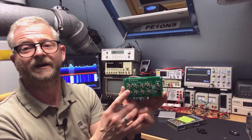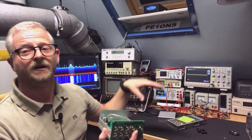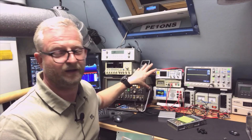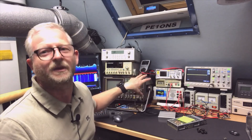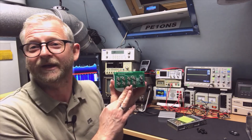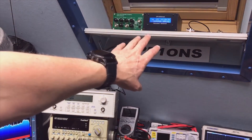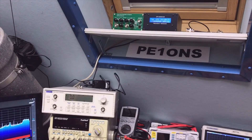So then I connect the 10 megahertz to the TTI and the 1 megahertz to the Marconi. Even though the Marconi is also almost spot-on, I still like to be sure. When I'm adjusting transmitters and receivers, you want it to be spot-on, and even if the temperature changes in this room I want it to be good. So let's connect it and see if this internal clock is any good. I have a little setup here with the GPSDO — now it's reading 10.0001, so that's accurate enough for me.